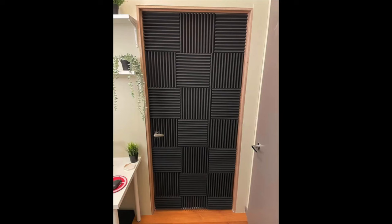One thing that doesn't really work for soundproofing the door is adding acoustic foam onto the back of the door. It'll deaden noise inside the room, but it won't truly soundproof it. If you're going to spend $25 on acoustic foam, you might as well buy a moving blanket for the same price — it will block more noise. Adding heavier, denser material onto the door will always do a better job than acoustic foam.